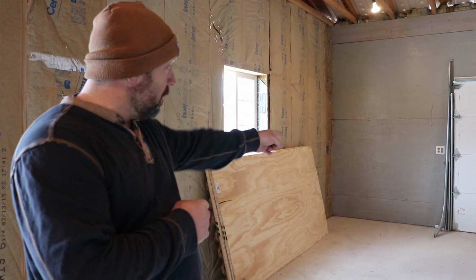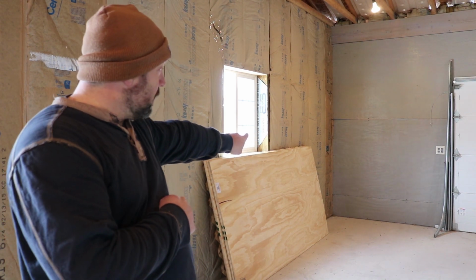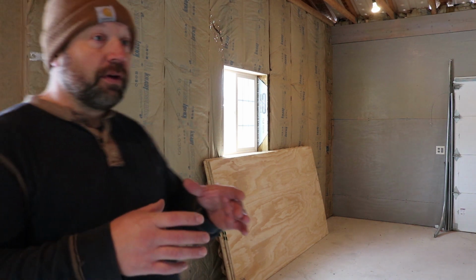Another item to consider is dust collection. So for me, I'm going to put a dust collector all the way down on that far side, and I'm going to run my ductwork under my bench all the way down. That way I can hit whatever tools I might have sitting on the bench. I'll have ports where I can close them off, and if I want to use a tool up there, I can open it up and hook it up.